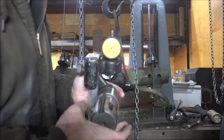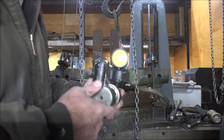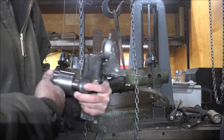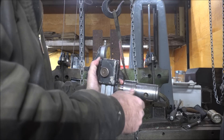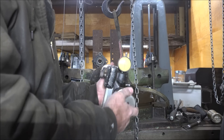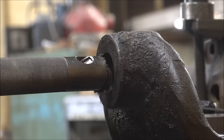I'm occasionally asked how I sweep bores and this is my tool of choice to do it with. It works kind of like a coax, but it's really just a straight indicator with a lever on it. It's on a V-groove so I can move this in or out, and I can make it internal or external. This covers up to about a seven-inch bore — if it's bigger than that I have to do something else, but this covers most of the work I do. Alright, let's go for a cut.